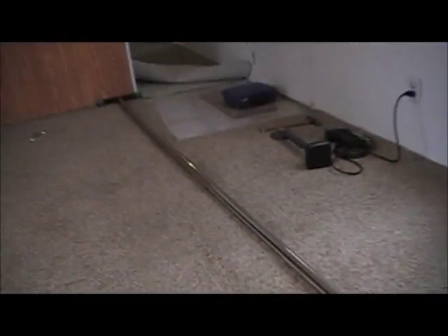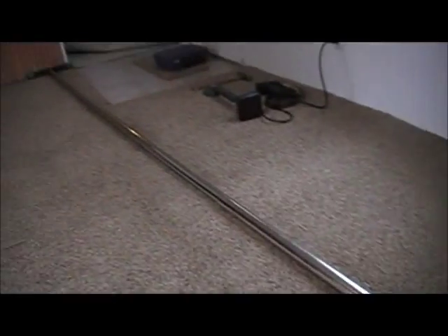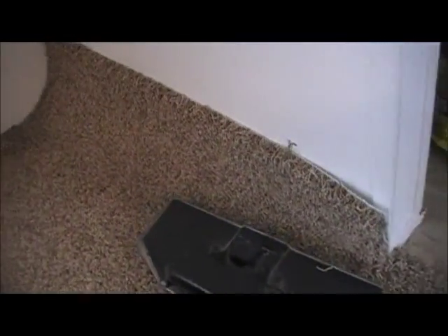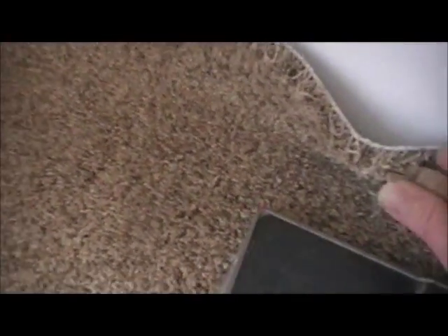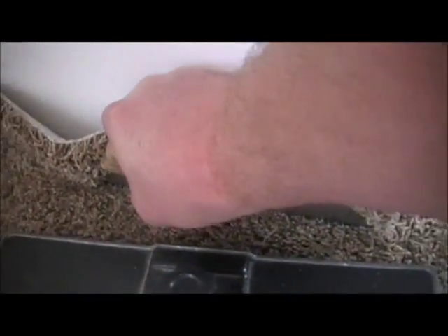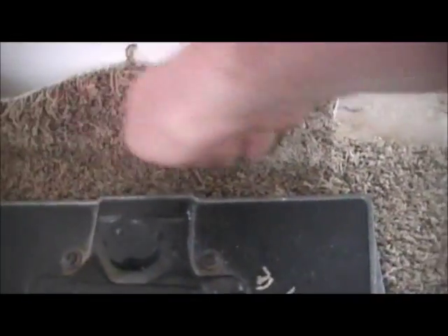Then you release your stretcher and move it over. Very important to keep this at an angle. Your first stretch you pretty much want straight on, but after that you want to angle towards the corner. I'll show you what a stretching pattern is a little later. That's just the way you have to stretch the carpet — just like pretty much any material. You've got to do it in a certain way or it doesn't come out very flat. I'm going to give it a stretch and then take this tool and hook it onto those little nails. The stretcher pulls the carpet up and then I push this down and release the handle. The carpet pulls back a little bit which hooks it into those nails.